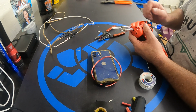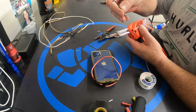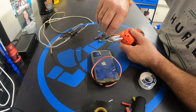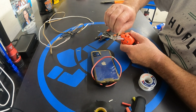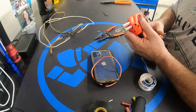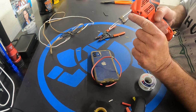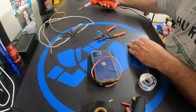If you have one of these, and after several uses it doesn't get hot as quick, it comes with this Allen wrench, and what you want to do is you tighten these little bolts here. There we go. You just snug them. They come loose from the heat. And the difference is when normally it would take 15-20 seconds, if it starts taking 25 and 30 seconds to get it hot, just make sure those are tight, and then you'll go right back down to the normal heat time.